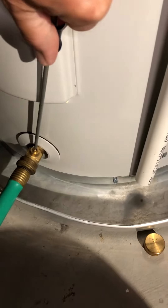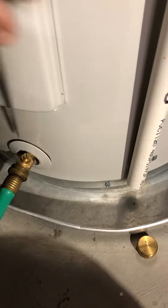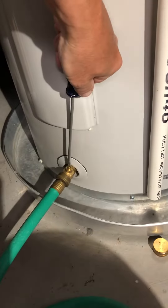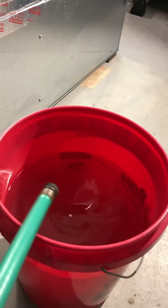You just open the valve down here with a screwdriver and you'll hear it open. I could go to the sump pump pit, but I'll just fill the bucket a little bit so it's manageable to lift and carry out of the basement.